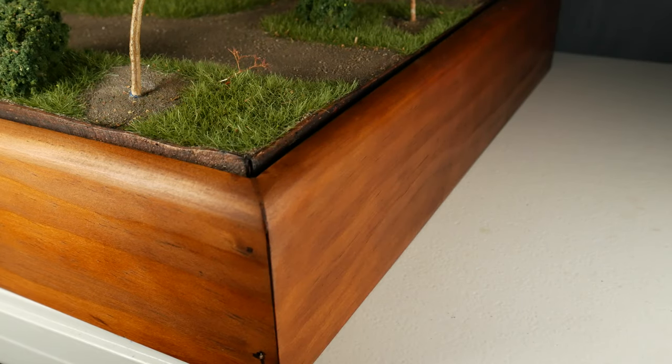Now, the wood itself, I gave a timber prime. Well, first I sanded it to 240 grit, then I used some timber primer, then a walnut stain, boiled linseed oil, and then a paste wax. Now, the way that I finished this wood gives it absolutely no protection at all from scratches or impacts or anything like that. It does make it resistant to liquids, but that's it.